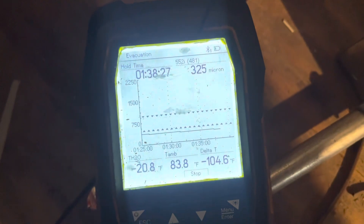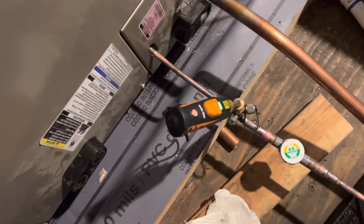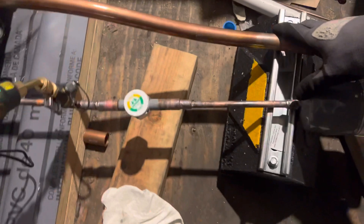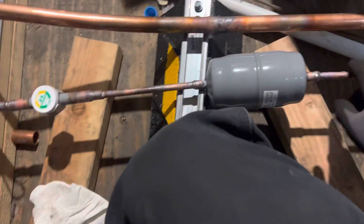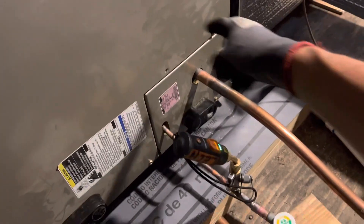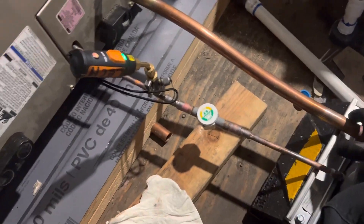I have it down to 326 microns but I'm not satisfied with that yet, because that's with the vacuum pump running — that's not in decay. If I let it decay it'll go up a bit. The micron meter is right there and the vacuum pump is outside on the roof, 80 feet away. I'm pulling with one hose through the suction line, so it has to pull all the air — or the nitrogen, since this is dry-filled with nitrogen — through the expansion valve, through all the windings of the coil, and then through the low side all the way to the vacuum pump outside. So it's taking a little longer than normal.